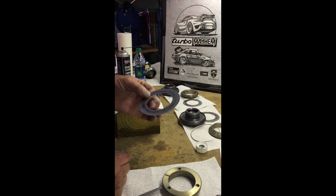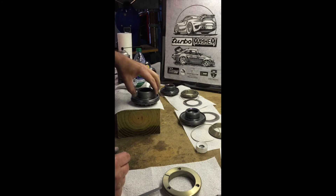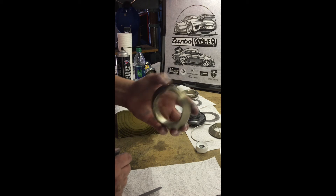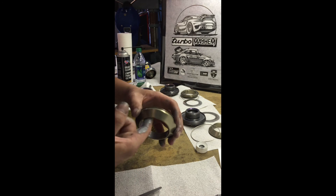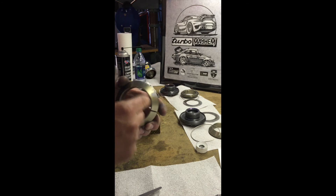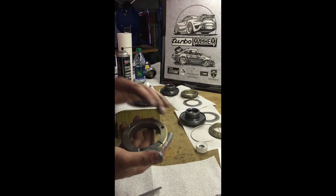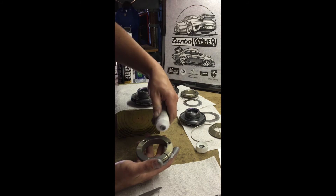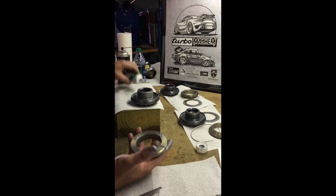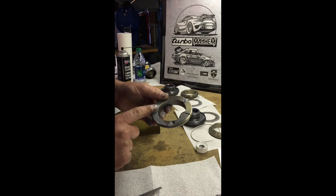It specifically says do not put any grease on this washer, so we don't put any grease on it — but it sits on the grease on the bolt, so no grease there whatsoever. Then we get to the circular area of the cone ring — around the back and around the inside. This also gets a light coating of grease. You see these three little bores — they want those filled between one-third to two-thirds. We start by putting a little bit of grease there and then work around the rest of it.